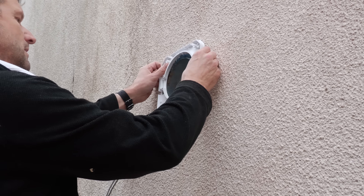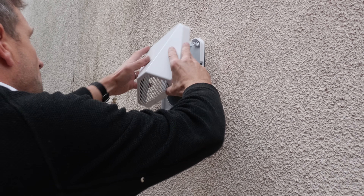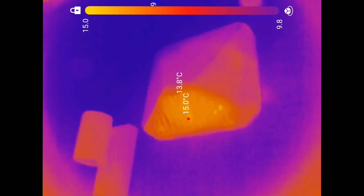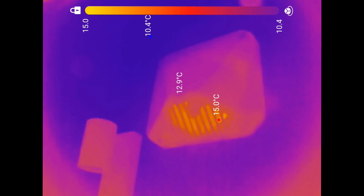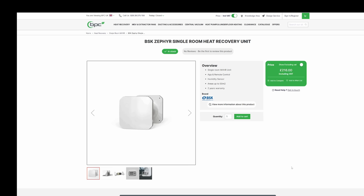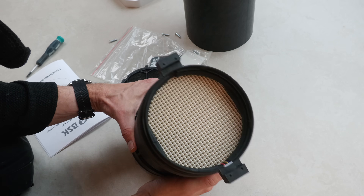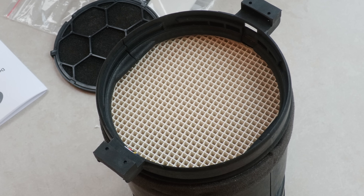I fixed the outer wall fixture part in place using the wall plugs and screws that come with the kit, and then fitted the all-important outer hood part. The hood is particularly important because, as Sam on Discord is always at pains to point out, a system like this has a ceramic heat exchanger and 70-second cycles between exhaust and supply which will not work properly if it's not sheltered from adverse wind conditions outside. To give you full disclosure, this unit was kindly supplied to me free of charge by BPC Ventilation after I got in touch with them — they haven't otherwise paid me anything or had any input into the video.